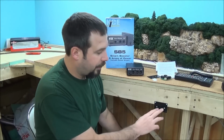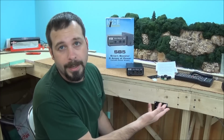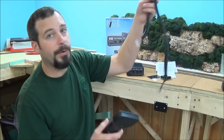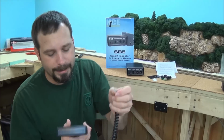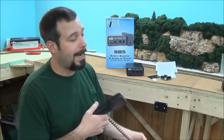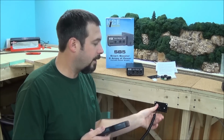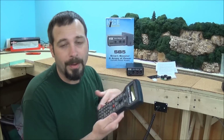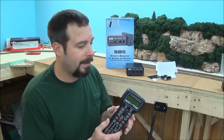Now, each UTP panel has 2 ports, so you can plug 2 different throttles in each port, which is great. And like I said, you would use the coiled wire, which only has 4 wires inside it, and that's how you would connect your power cab, which now would be in essence a pro cab, into either one of these ports, and it will fire up, and you'll be able to go through whatever processes you normally would with your power cab. Now, the drawback.